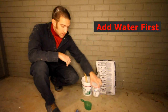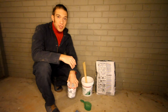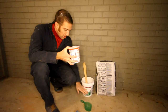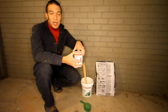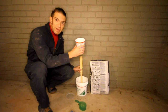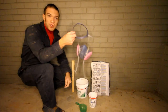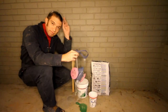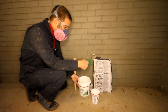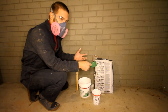When you do this mixing, you're definitely going to use water first. If you add the powder first, when you pour the water in you're going to have dust everywhere. So put water in first, which means you need to have an idea of how much material you're going to use. My package says to use about six quarts for the entire bag, so I'm going to use about three-quarters of one quart, which should give me approximately half of this one-gallon bucket of final mixture. You want to be as close to room temperature as possible — you absolutely cannot use this below 40 degrees or above 95 degrees. Put your respirator on; this is similar to drywall dust and it's a very fine particle that will get into your lungs. Safety glasses too. The goal is to get to the consistency of peanut butter — thick enough to hold its own, but not so thick you can't spread it nice and smooth.